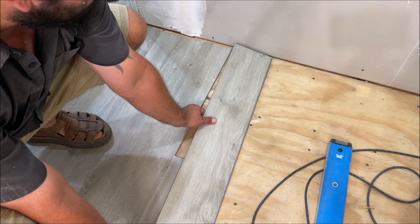Here's a tricky one — you have two contours on both sides. Do the hard one first. The contour gauge is not big enough for this, so we're going to have to do the cardboard method. Any cardboard will work but you have to have a straight edge on it somewhere. In less than five minutes I have it cut out and ready — let's test this fit.